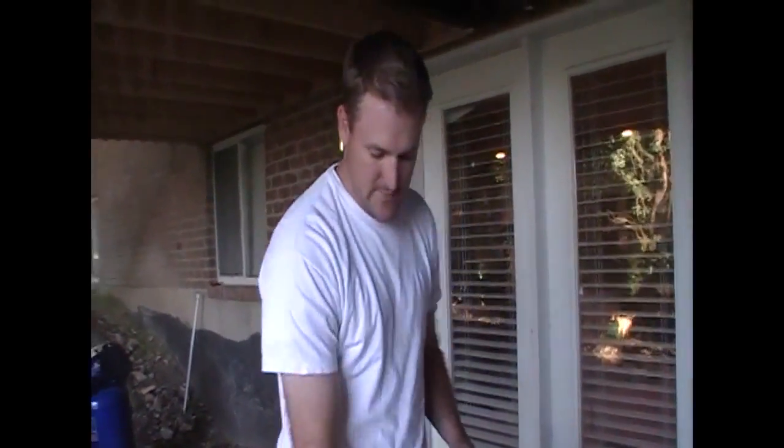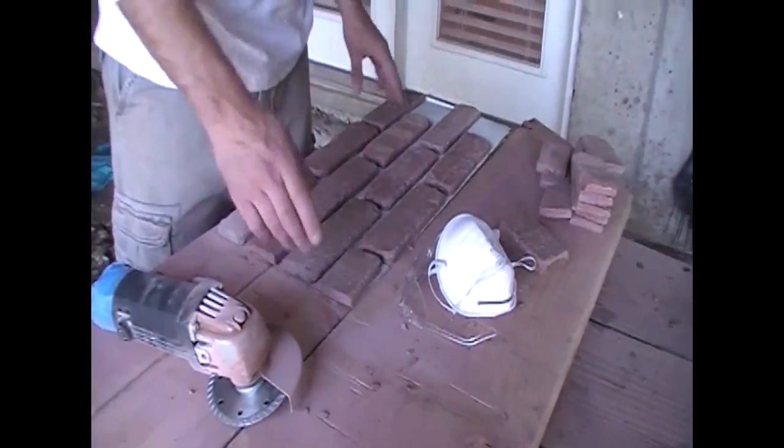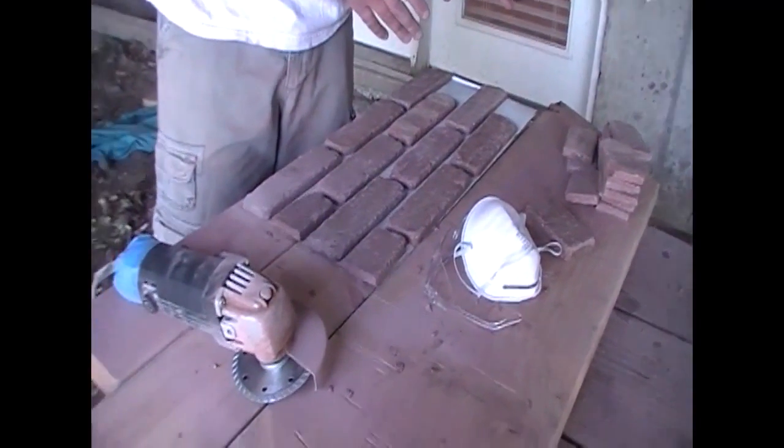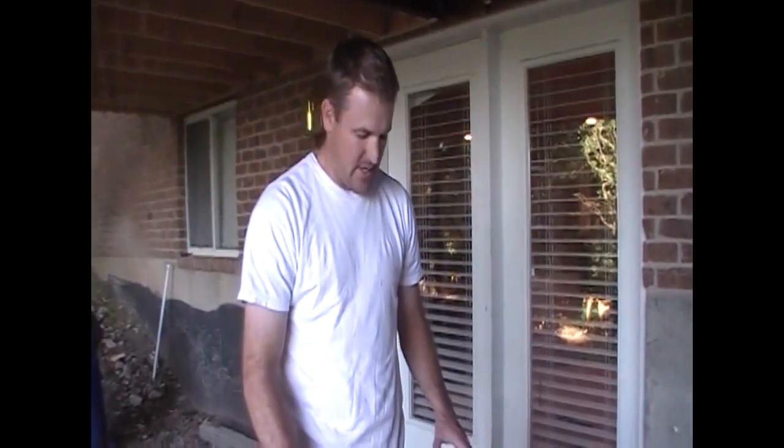A couple of reasons why we're cutting the ends of this is so that we can have a nice flat edge. They're already staggered so that when you lay the other sheet over the top of the other BrickWeb, it's super easy to align. So we've got these cut — let's go ahead and start installing.